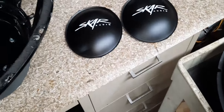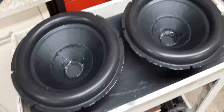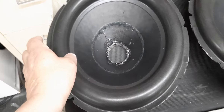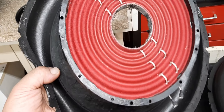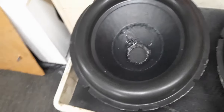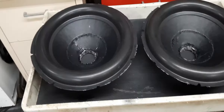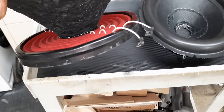They're nice and stiff, thank God, or they wouldn't have been as easy. Then the rubbers, then the spiders. I'll slide the new coils in here, solder them on, set it down in, and bolt them in — it's pretty self-aligned. Make your own rebuild, drop-in cones. I didn't hurt the surrounds, I didn't cut the spiders, I didn't do nothing. People just want to tear right into them when you can just replace the coils.